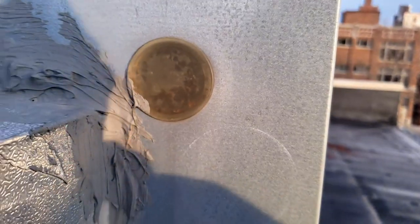I can't see anything through the inspection port — it's pretty much useless. I went ahead and put a small hole in it. You can see the flame sensor and the burner orifices, and you can tell we've got some disturbances over on the right-hand side. The flame isn't quite where it should be — it's rotating down and should not go all the way to nothing on the right side. We may need to clean the pilot holes and burner holes.